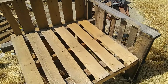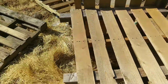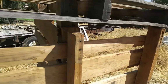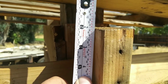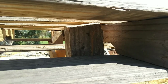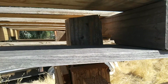Alright, we're secured with 2 screws each on the posts and 1 connecting it to the back wall. Now we just do the other side. And this is the part where I need to fix my inaccurate cuts. You can see I'm 2 inches taller than where I need to be at the furthest point of this 4x4. So I measure 2 inches down from that, and I cut level, and that should fix it.